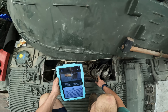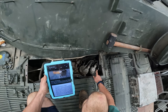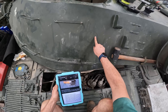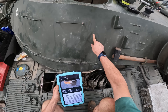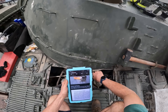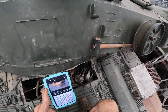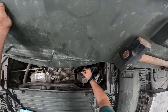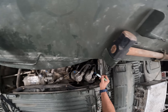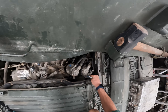So the inner mag is the right, outer mag is the left. The inner mag fires the flywheel end spark plugs and the outer mag fires the accessory end spark plugs. That gives us a little bit more information when it comes to looking at spark plug colour and condition. I'm going to put a nice prominent R and L on these covers.